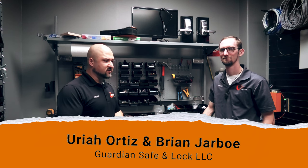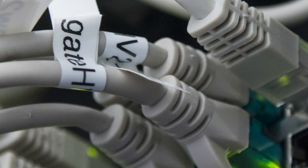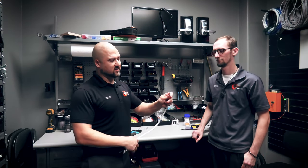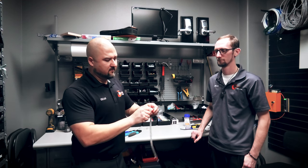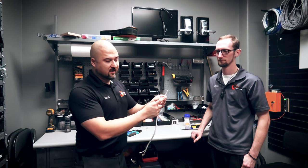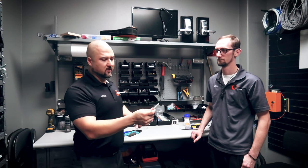Thanks for joining us today. We're going to discuss how to terminate camera wires. If you've ever done installation of camera systems, there are really two types: HD over coax and IP cameras. IP cameras work off of a CAT5 or CAT6 network cable, and HD over coax works off of RG-59 siamese cable. The RG-59 siamese cable has your RG-59 for video and red and black wires for positive and negative power. This takes power to the camera, which splits off to a power supply, and goes into the back of the camera and the back of the DVR — digital video recorder — because this is analog.